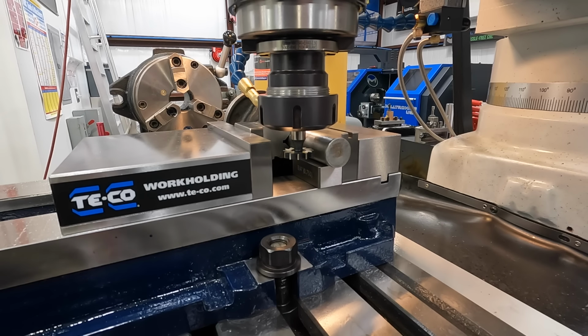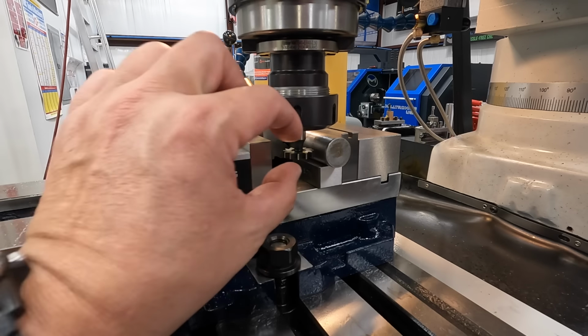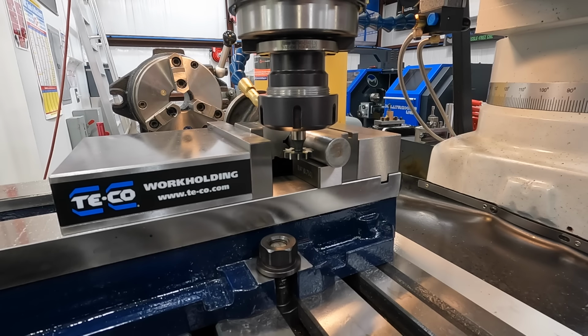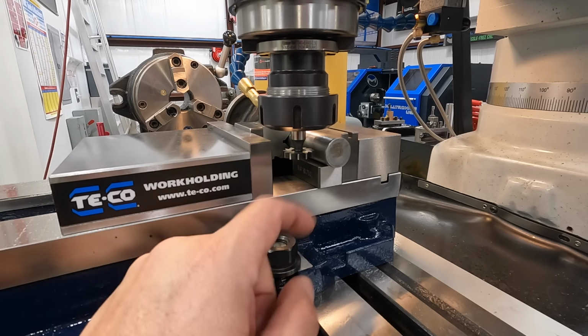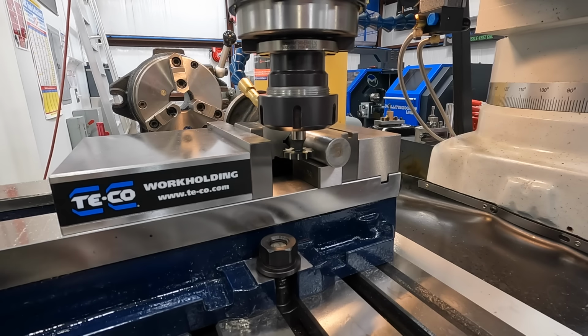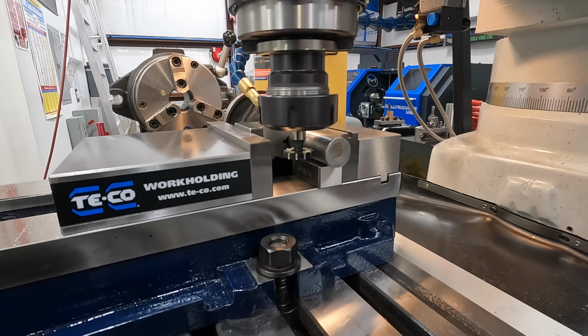First thing I need to do is get the cutter touched off on a flat. So I want to come in and cut the radius of the shaft until the full width of the cutter is actually cutting. At that point, our depth is going to be 0.339. And you can pull this stuff up in the Machinery's Handbook under the Woodruff key seat section, and it gives you all of the information you need to know for whatever size key seat cutter that you're using there. Generally run these cutters kind of slow. Also helps with chatter and vibration too.